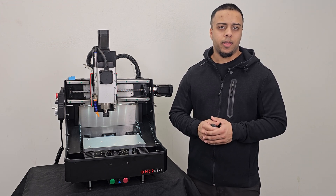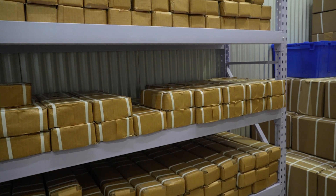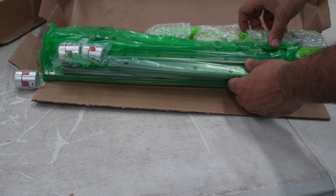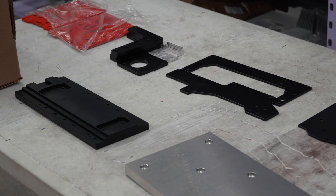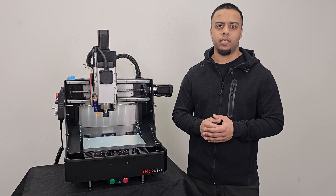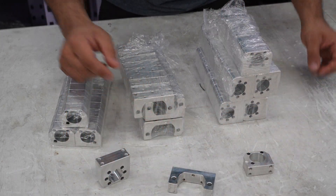Now I want to talk about some features on the DMC2 Mini that are not apparent at first glance but still important to mention — that's to do with the actual user experience of building the DMC2 kits themselves. About 90% of people opt to buy the DMC2 machines as a kit rather than an assembled unit, which saves money, lets you build it yourself, and saves on shipping since the kits ship in dense small boxes anywhere around the world right to your doorstep. We've trimmed down the amount of components on the DMC2 Mini — less pieces to assemble, more pieces doing double and triple duty — a more optimized design that still retains the structural rigidity needed for a CNC. We've also transitioned to CNC machined components wherever possible, and even though they cost a little more, having less components overall still manages to reduce the final cost of the whole machine.